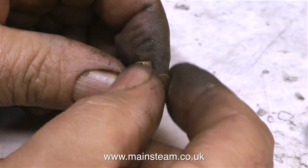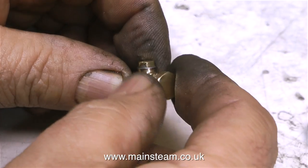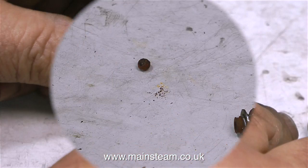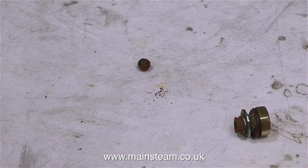Sometimes they do not. If you look closely at this clack valve — and I'll pause the video so you can see it clearly — you will notice that it has three aluminium washers fitted: one where it goes into the boiler, one to the top cap that I've just removed, and one is also fitted to the small blanking plug at the front of the clack. More about this later. For now, it's time to have a look at the internal contents of the clack valve. And what's this? A rusty ball valve? This is most unusual. Definitely not a Stuart part. In the bottom right of the picture is the top cap that I've removed, and you will notice that the unthreaded centre part is longer than it needs to be. It's designed like that to limit the ball travel.